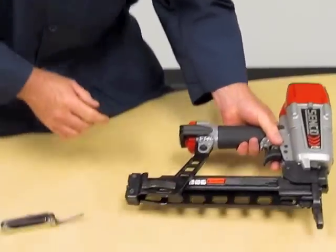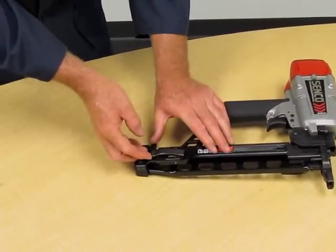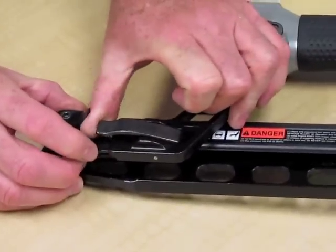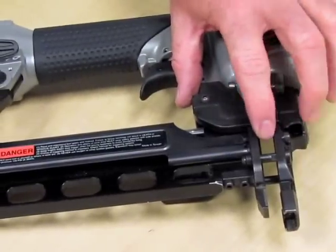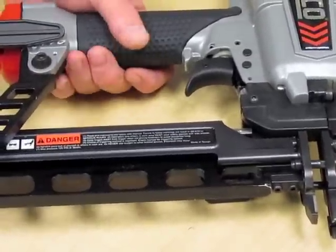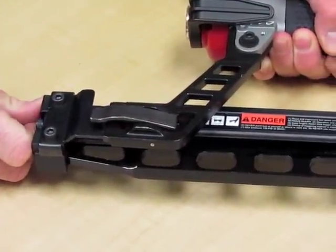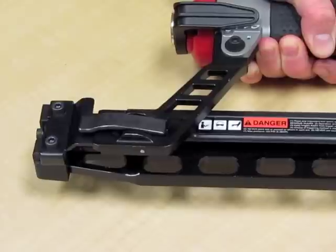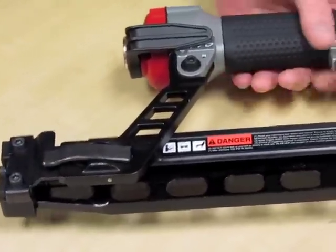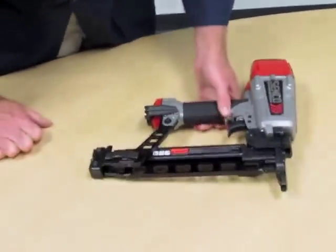The other way I'm going to test this is by checking the quick release lever. If you happen to get a jam with this tool, you can release this lever and that allows you to pull the magazine open. At the front end, you've got an opening to clear any kind of jam that may occur. What you're testing here is when you go to close it again — you want to keep an eye on the locking lever. When I close the track, I want to see that lever drop all the way down into a fully closed position. And that looks really good — this one is in adjustment and this is a tool that's ready to go back to work.